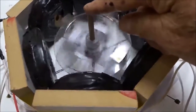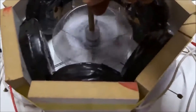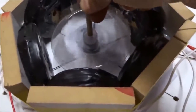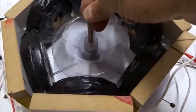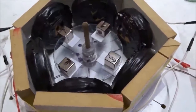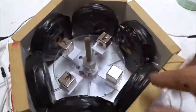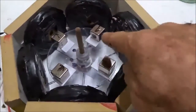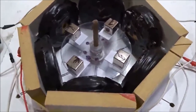We can spin it whichever way you want — very, very nice and easy. And it spins beautifully. We made a nice beautiful synchronous motor and there's no issues at all. Stepper motors use something like this; I have to find out what they've been doing. Six and four, three-phase power, UVW UVW, six coils, four magnets — NNSS for anticlockwise or NNNN for clockwise. I don't know the theory; I'll figure it out later.